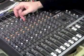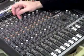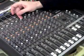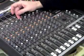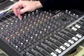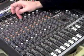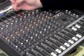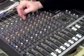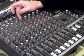It also eliminates a lot of the rumble from rough handling of microphones, some of the vibration coming up through the mic stands from the stage, a lot of the pop and the hiss, the breathy stuff from poor microphone technique. So that low cut filter, it's advisable, well Mackie certainly advise anyway, that you engage that filter on all channels where a microphone's being used for vocals. That low cut filter, just click it in and that's you. Any frequencies coming in then below the threshold of 100 Hertz get cut, and it just keeps it nice and clear and eliminates any muddiness from the signal.